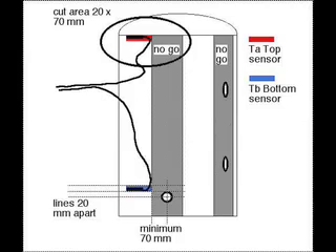How do you connect your sensors to the cylinder? You don't want to sense the wrong thing. Don't measure above or below where a pipe goes in — temperature differences could cause warm water to rise or cool water to flow downwards near a pipe entry, giving you the wrong reading. Make sure your sensor positions around the cylinder are at least 70 millimetres to the side of any pipe. The top sensor goes on the seam between the cylinder and the dome. Take off a rectangle of insulation — 70 millimetres left to right, 20 millimetres up and down. Insert the sensor so it is in contact along its length with the metal of that seam, then re-insert the insulation in the same orientation and tape the cable to the cylinder.